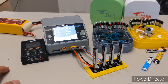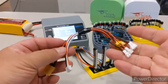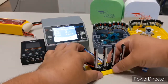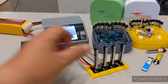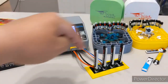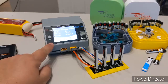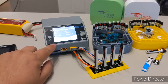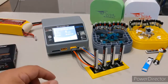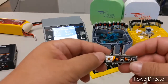If you have a need for something like this and don't want to build a harness — I used to do that, but this is just so much more convenient. I can access my packs and I put a little bit of space between the cells so my fat fingers can fit in there. A few recommendations: you do want to fly them all down to about the same voltage. The charger will take longer if they are too unbalanced, but it will still balance them.